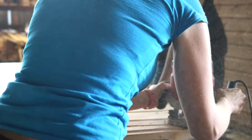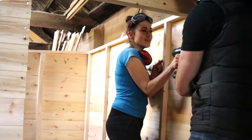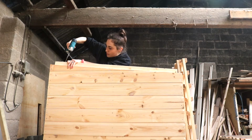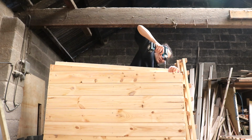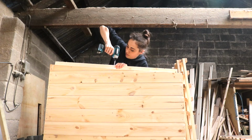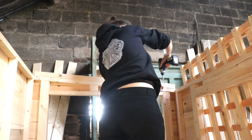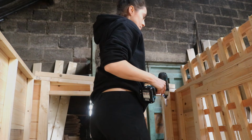And before I started on the roof and doors the next day, I had help propping up the panels on the base so I could screw them all together and see it taking shape. The next morning, I screwed down some roof locator blocks directly on top of the two shorter panels frameworks, making sure they're flush on the inside, but also short enough so I could run some roof spars along the front and the back. I'll show you in a minute. But the roof's cladding will later sit directly on top of it, and this gives me another area to anchor down the roof from the inside.